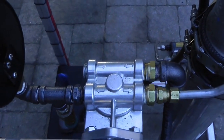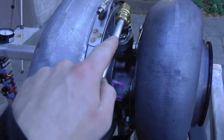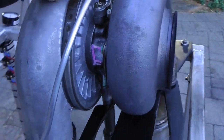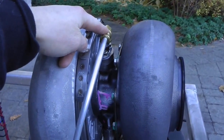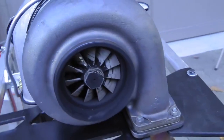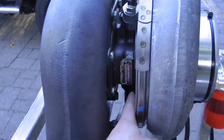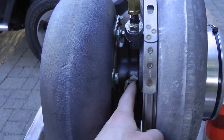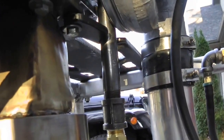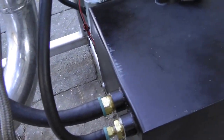The other place that the oil can go is straight to the turbo, which comes from this 3/8 steel line and goes right into the inlet of the turbo. The turbo has a hydrostatic bearing, which means there's a shaft that basically floats on a cushion of oil around two bushings. The oil then goes through the turbocharger, lubricates the bearing, and cools the shaft itself, then exits through the outlet, down the 3/4 inch hose, and back to tank.